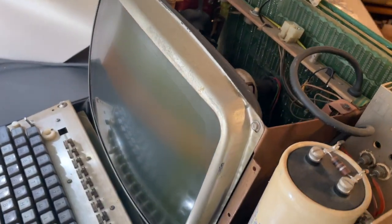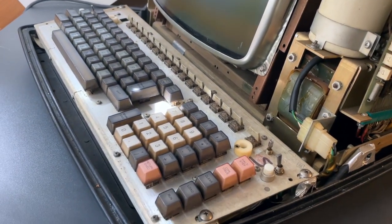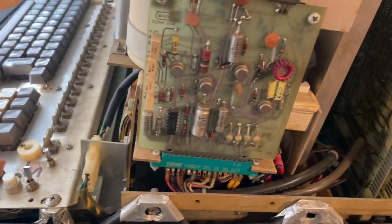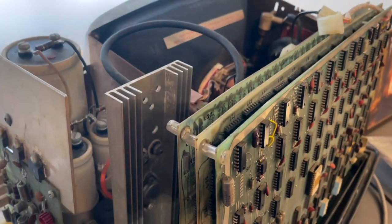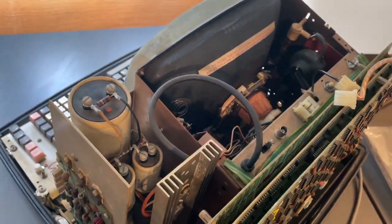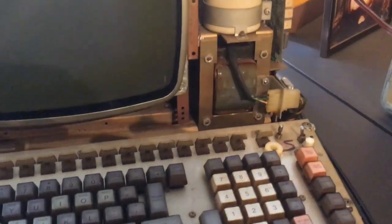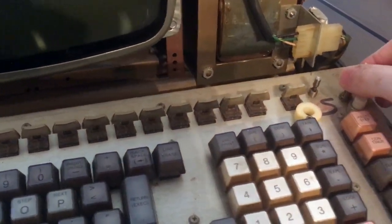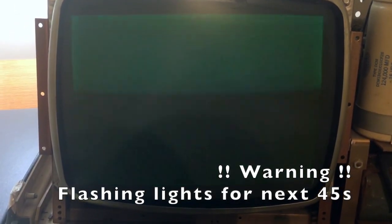The CRT assembly is old but I think is working. There are some enormous filter capacitors for the rectifier. A very solid metal keyboard with robust switches. That pass transistor connected to the huge heatsink probably gets very warm, so I will change it later. Now the seller turned it on to make a picture, so whatever was going to blow in this computer by turning it on has blown already. So I turned it on after a quick inspection, trying to see if I get an image.